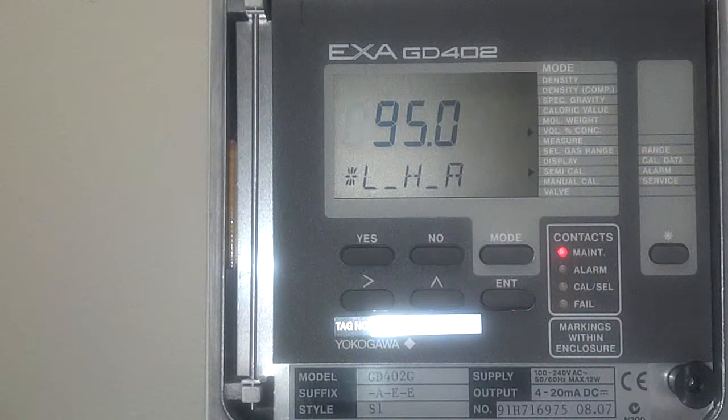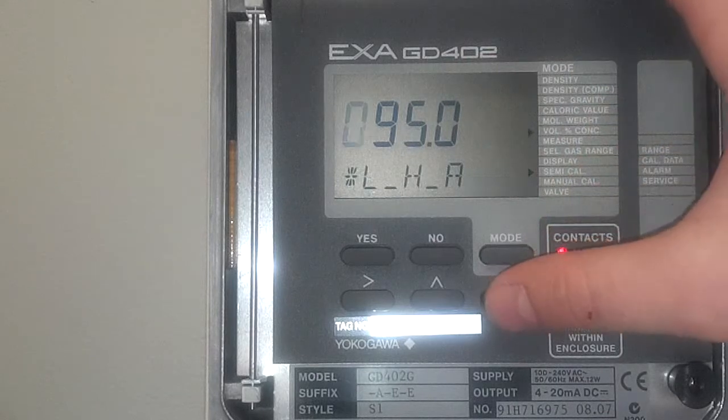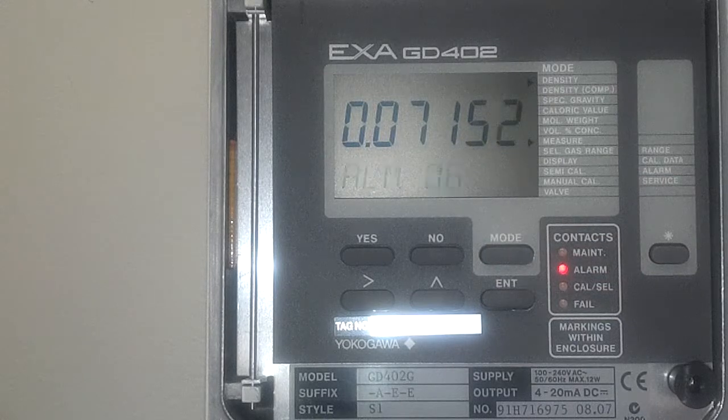Low hydrogen at 95% — that's a good value if you're looking for pure hydrogen. Basically this sends an output whenever you get to 95%. Go ahead and go with this value, press enter, and press mode once again to escape. And basically you're set back on your unit.